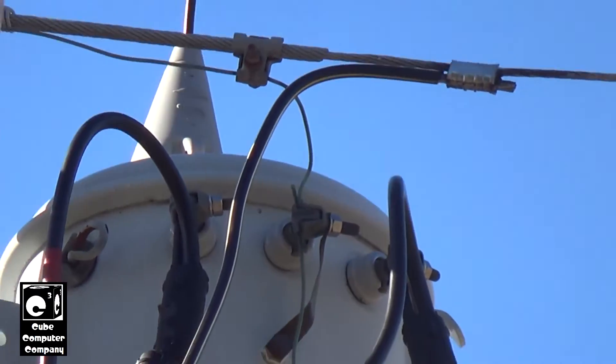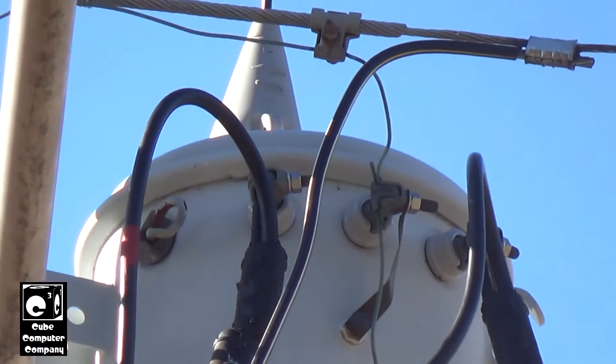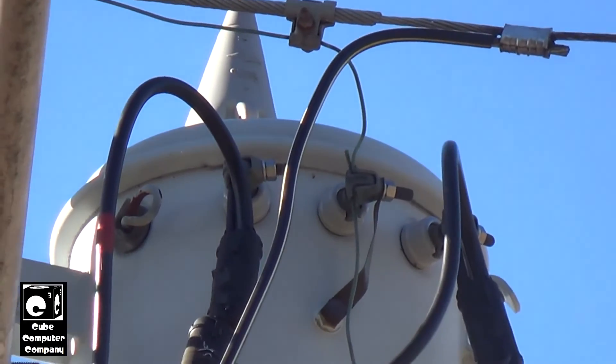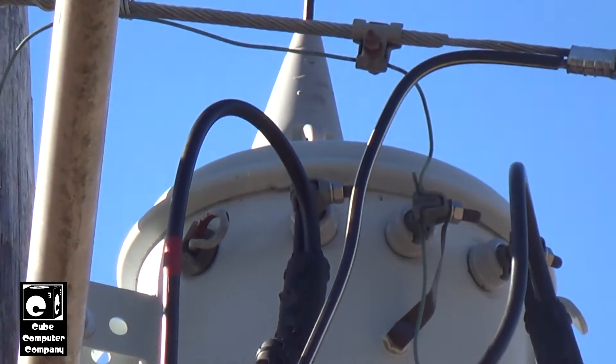In a Y bank, they would open this transformer and change around the taps so that instead of having two separate 120-volt taps, you would have the two secondary windings in parallel with each other, so you're not wasting the transformer. There is actually a third method — using single-phase transformers in delta banks. In that case, they'll often detach the center tap grounding strap from the can, because in delta it's generally not used, depending on the wiring configuration — sometimes it is, other times it's not.